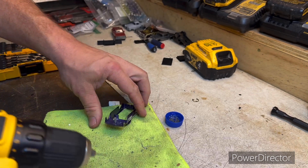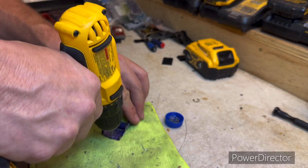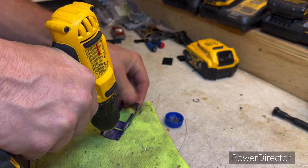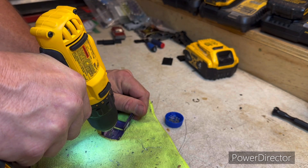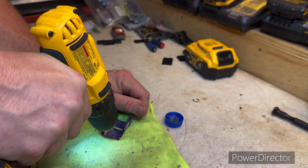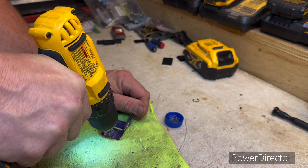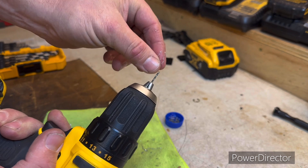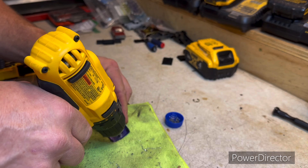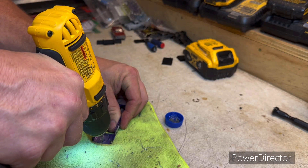Go low RPM, you're not in any hurry here. Take your time, you're not in a hurry. Getting in a hurry causes puncture marks in your finger — learn from experience. Also these little bitty 1/16th drill bits will snap at almost nothing. Back it out, put it in reverse if you want to clean all that shrapnel off. Keep your cutting edges nice and clean because it does clog up.